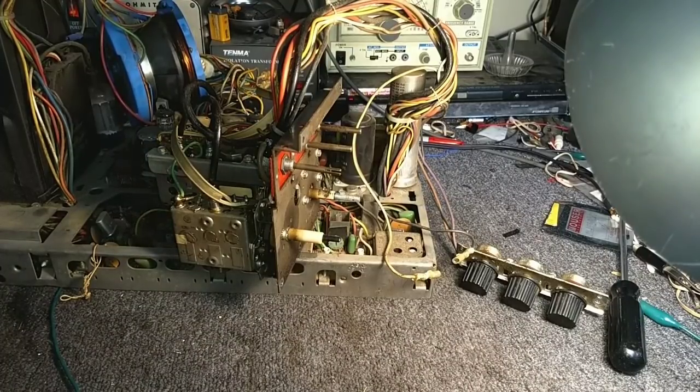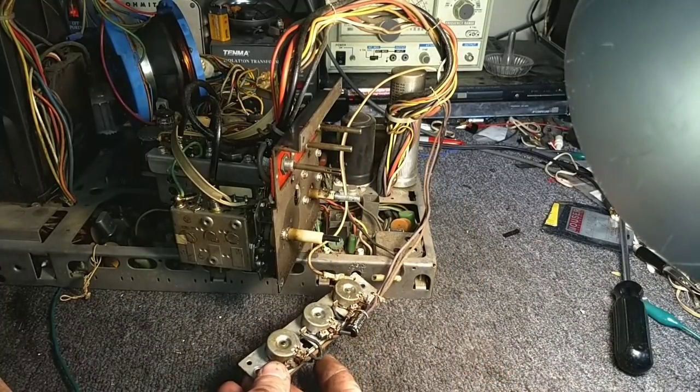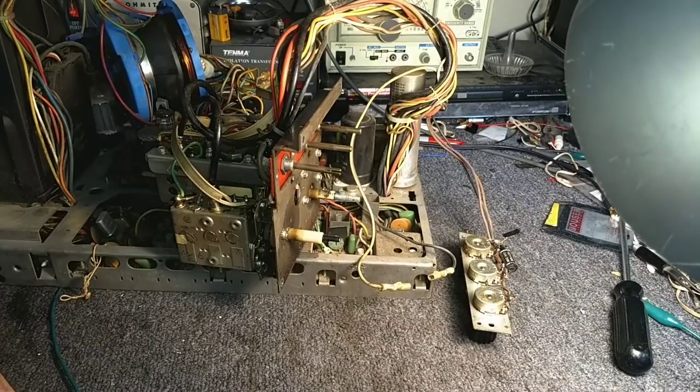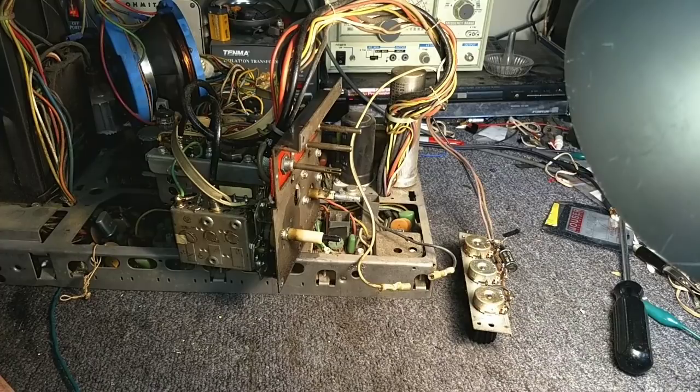The color worked normally and the volume worked normally, but this tint control was just dead. I need to find something with a relatively long shaft to cut down because the knobs are weird. There's also an electrolytic I missed there — 50µF, it looks kind of cooked. The brightness and contrast were kind of on or off too, but I'm not going to mess with them because the circuit actually still worked, so I might just leave that be. That's enough information that I can proceed on repairs: installing the capacitors, replacing the electrolytics on the low voltage side, and replacing that tint control. So thanks for watching this segment — stay tuned for part three.